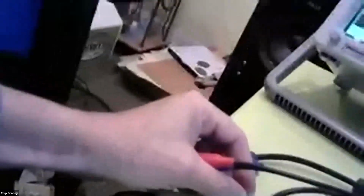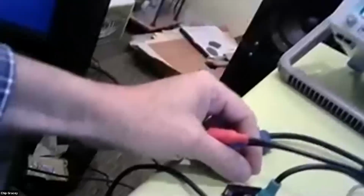And it's actually what you see, this monochrome image is a single pin off the chip. It's in 75 ohm mode, and it outputs 2 volts. So when the TV clamps it with another 75 ohms, it drops to 1 volt peak. And so it's just this. See, if I pull this thing off, let's see, try to get both in the view. Pull this thing out, signal goes away. Plug it back in, signal comes back on. So that's 1 pin monochrome.